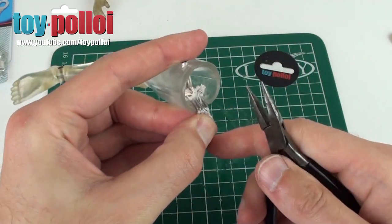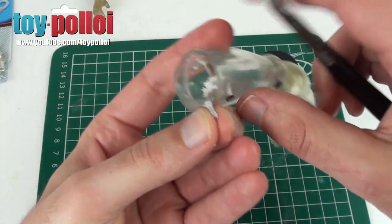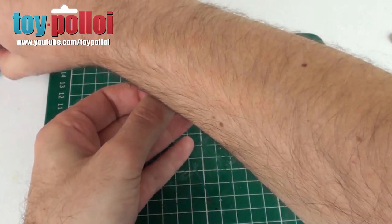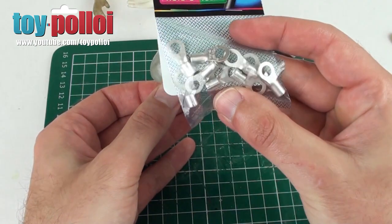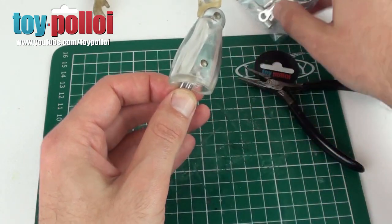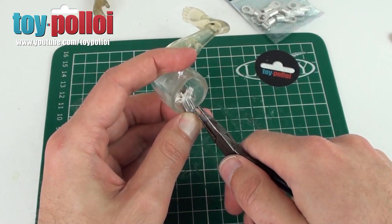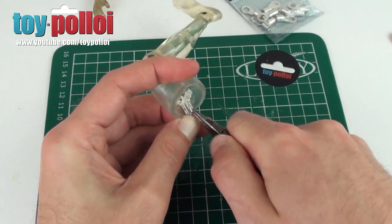What I want to do is use a pair of pliers to gently unclasp this little metal clasp here. These little hook pieces are impossible to get off because of the way they are constructed, but if you want to buy replacement ones they are called crimp connectors. As you can see I have a few here — they're used in electronics and these are basically the same thing. The problem is the metal bar is riveted in place, so we're going to use a pair of pliers and try to gently bend the metal out of the way.